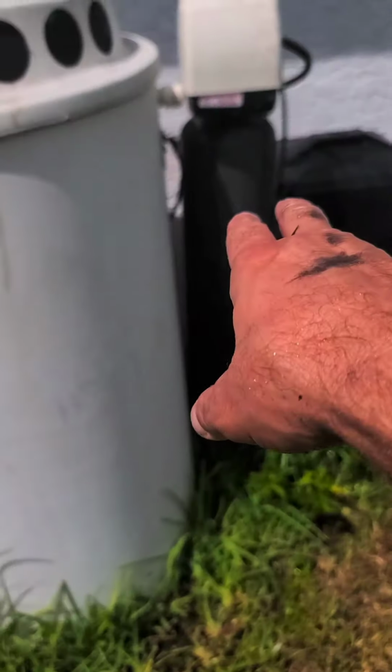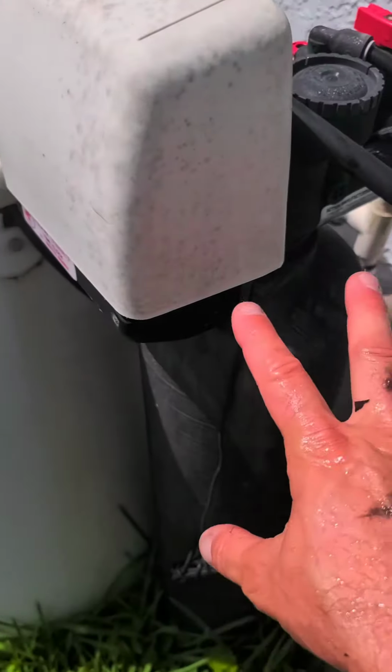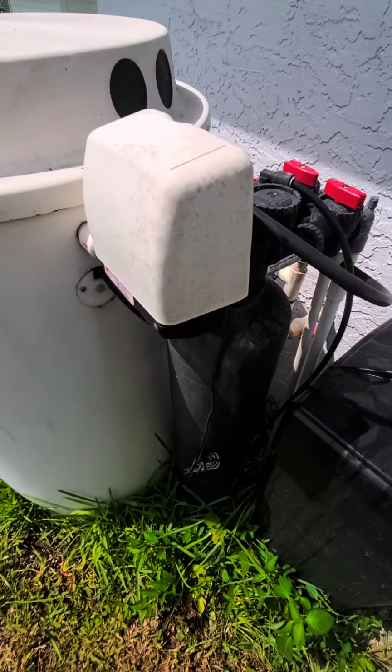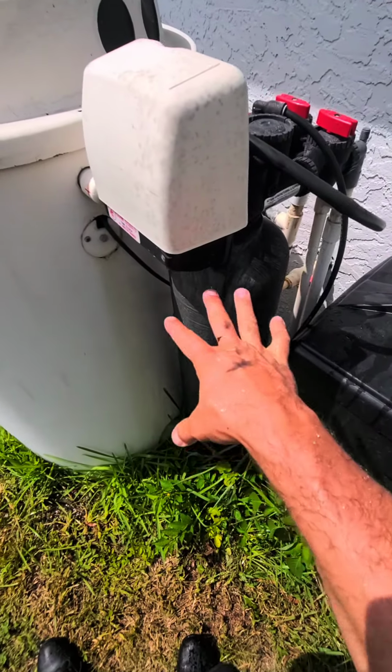And then the water softener, again, it's in bypass. So the only thing you could try to do is clean the inside and get it to work, and chemical clean it. Then turn it back on and see if the smell goes away. If not, then you have to repack or replace the stuff that's inside.